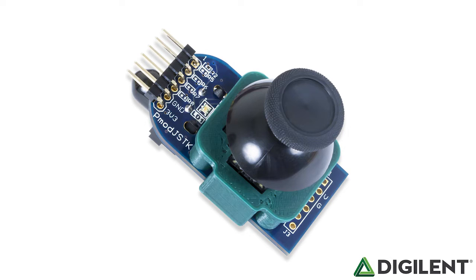The PMOD Joystick is a user input PMOD using the SPI protocol. It has 1 button, 1 LED, and 1 joystick. In the claw game, I use the joystick to determine the direction of each of the stepper motors. The raw joystick data is converted to right, left, up, and down.